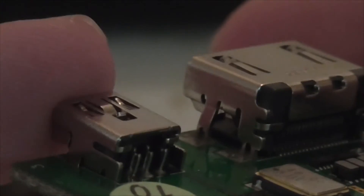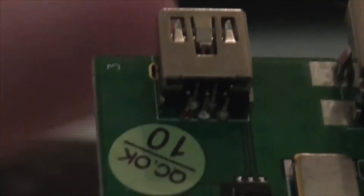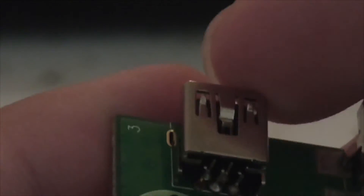And there's the solders. Right here you can see that it moves and it's not supposed to move. It actually comes up from the back. So this needs to be put back in place by soldering it again. You need to go out and get it re-soldered so it can't move anymore and the computer will be able to recognize the USB again.